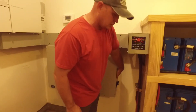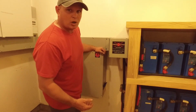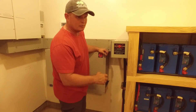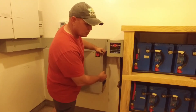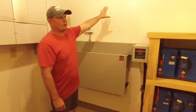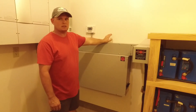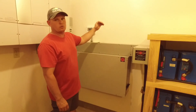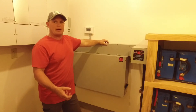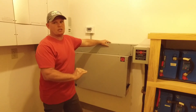On the side we have multiple spaces for adding breakers — right now we have three 250-amp breakers for each string. If there's a problem with one string of batteries, they can turn off that one string and continue running. If we need to service them, we can shut down a string at a time and keep working. There's also room to add solar breakers and all different types of stuff. When we come back for next season's upgrade, we'll be able to put another XW inverter right here and use the Midnight enclosure. It's much more condensed, and that one inverter is effectively going to bring the hydro up to 240VAC, pretty much making it like a digital battery charger.